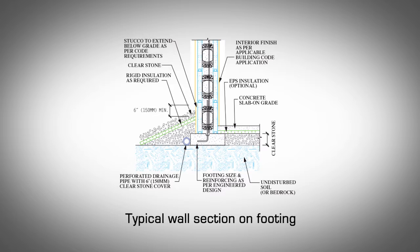This method is also preferable when a radiant floor heating system will be used or if the final floor finish will be stained and sealed concrete. Footings and Walls for a Raised Floor: If the first floor will be a raised floor, then the wall must be started off of a footing. In some cases, builders will elect to pour two to three courses of block initially and then install their floor system. Once the floor has been installed, continue stacking block.